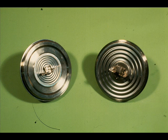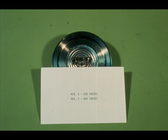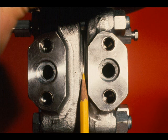We have previously learned that there are two range capsules for the E13DM. One is stamped 205 and can be calibrated from a minimum of 0 to 20 to a maximum of 0 to 205 inches of water. The other is stamped 850 and can be calibrated from a minimum of 0 to 200 to a maximum of 0 to 850 inches of water. The present range of our transmitter is 0 to 50 inches, therefore the present capsule is suitable for the 0 to 150 inches.